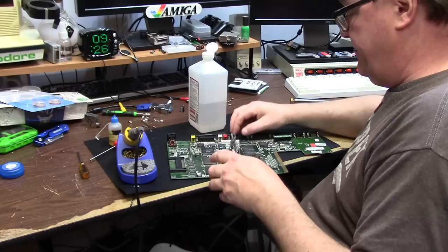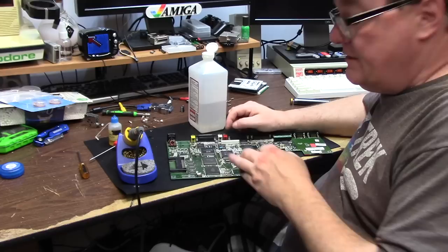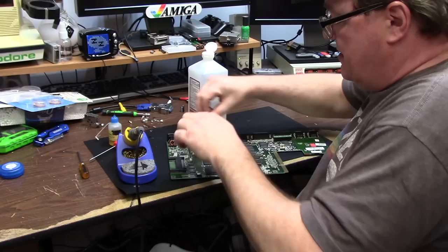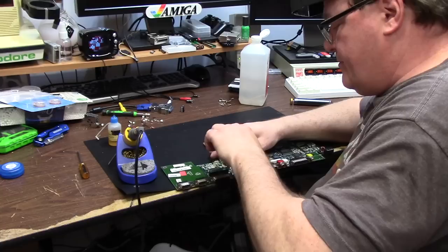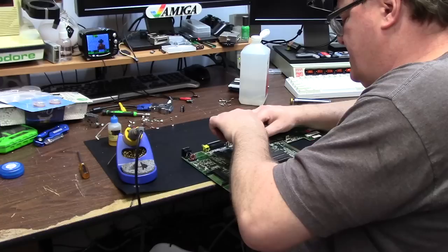The trickiest one you're going to run into is the one right here, 1622, that is behind the keyboard connector. And the trick with that is to not use a 5 mil, but a 3 mil cap. Relief cut, peel off the aluminum. Now I'm going to remove all my things, and I'm going to do the keyboard connector one live with y'all,